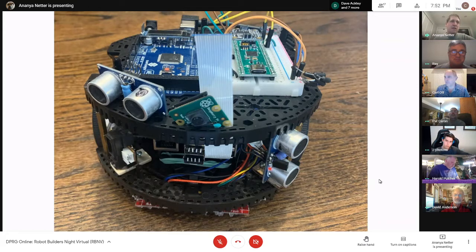This is a standard Sharp IR. They're obviously smaller and maybe a little easier to place. I'm playing around a bit with the USB wiring, because I do plan on having a USB link to my green pill. The standard USB cables tend to be fairly robust with the connectors, but a bit more bulky, so it gets crowded there in the front. So I have these little breakout USB type A male connectors that I'm thinking of soldering a couple of wires to, just to have something as low profile as possible, so I don't have as much bulk going on. Honestly, I don't know if I'll have the signal integrity I need for USB, but I'm going such a short distance that it might not be an issue. So I'm going to give that a try just to cut back on the bulky cables a little bit.